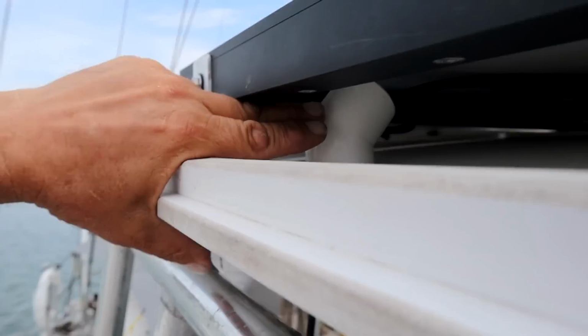What I did here, this is pretty cool. You need to see this. So in order to get the wires inside of the bimini top and keep it reasonably waterproof, the nice thing is this expanded foam PVC, I can glue any PVC other items to it. So what I did was I took, I think it's a 1.25 inch 45-degree elbow, cut it down a little bit, and I drilled a 1.5-inch hole in the top of the bimini where I wanted it, and then I glued the elbow down over the hole, which gives the wires an entrance. And that's what this guy is right here.